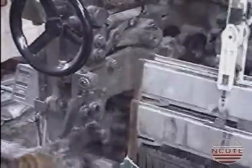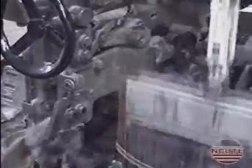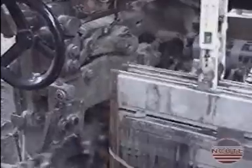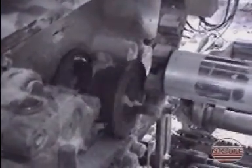See the working of the terry cam which actuates the curved plate for making a three-pick terry weave. This is a close-up view of the action of the terry cam. This is where two terry cams can be mounted for controlling two curved plates.